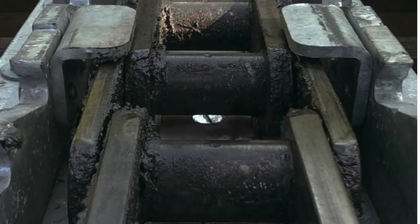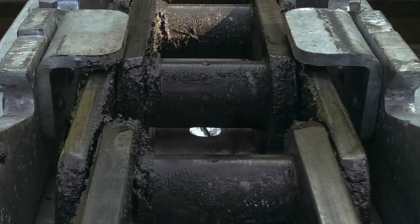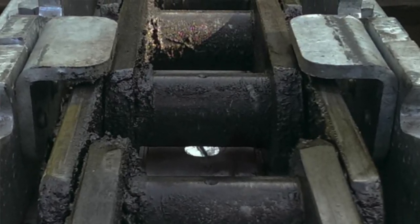So what you would be dealing with is if I broke the chain at the top, right at one of those hold downs or just past a hold down, and the chain were to start sliding backwards, it starts to bunch up. The chain bunches up in one spot right before a hold down. And then if the chain continues to slide, it'll basically go right down to that point and catch, and it stays in the trough.